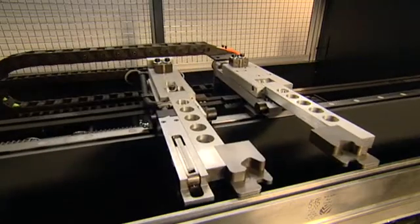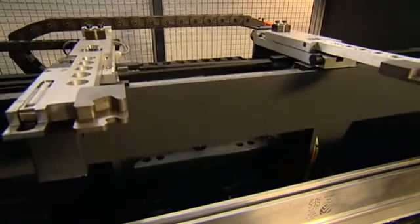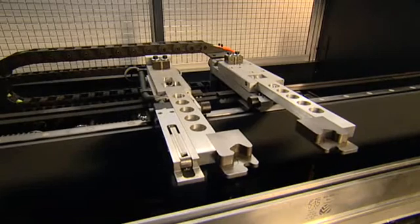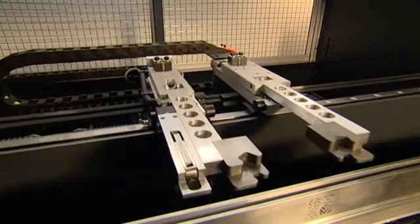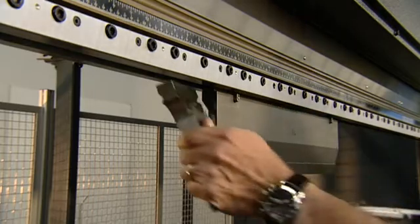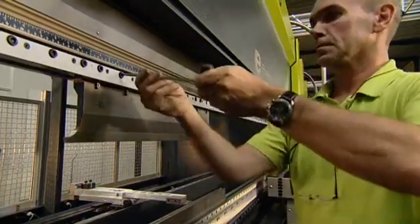The standard version of the e-brake is equipped with a CNC-controlled X-axis. Control of the R-axis, Z-1 and Z-2 axes, and a delta X-axis are optional. The complete 6-axis back gauge is available for heavier e-brake models with press capacities of 150 tons and 200 tons. A selection of tool clamping systems is available, including both mechanical and hydraulic clamping systems.